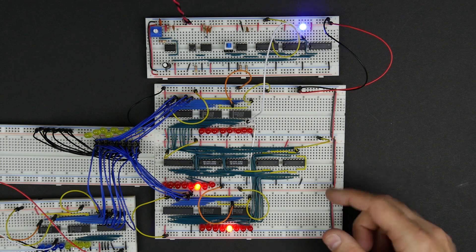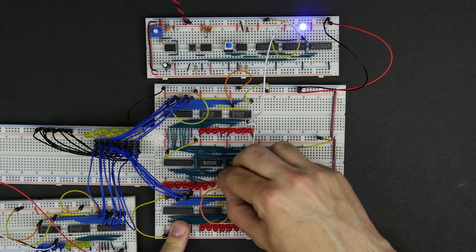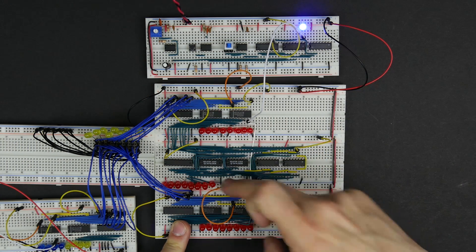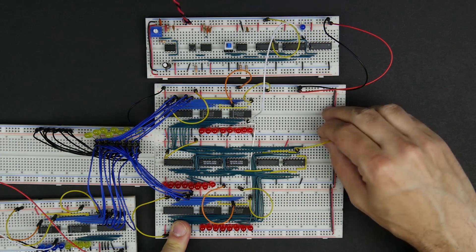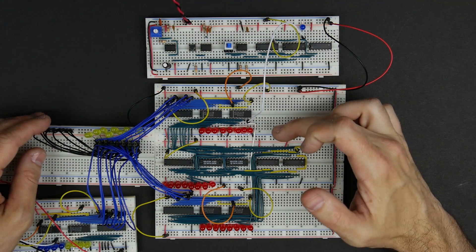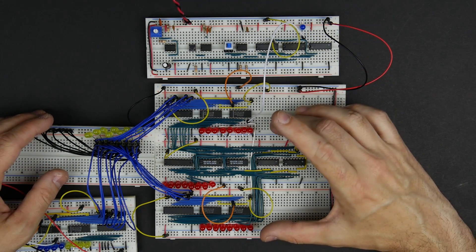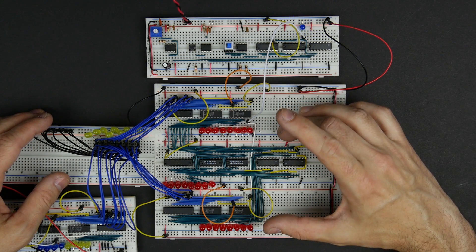What I'm thinking as a place to start is to set both registers to zero. I cleared the B register, and now with A and B both at zero, the output is zero — that's a good sign. Zero plus zero equals zero. Then I switch to subtract: zero minus zero is also zero. So that's what we'd expect to see. Now we can try different values and test in different ways to see if I can isolate parts of the circuit that are working correctly, or maybe parts that aren't.